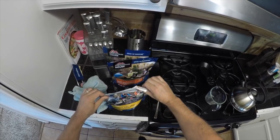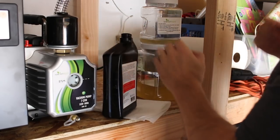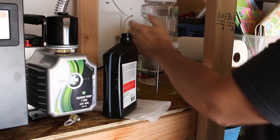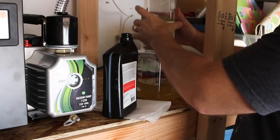Let's discuss maintaining this machine, specifically the vacuum pump. After each batch is done you drain the oil from the machine and then filter it. After about 20 cycles you have to take apart your vacuum pump and service it — something I'm going to do this week and will probably make a separate video to explain that process.